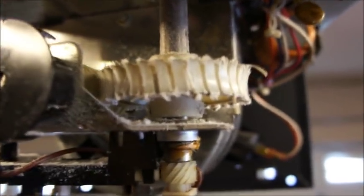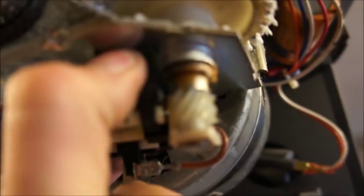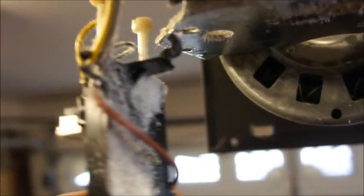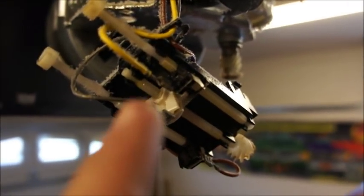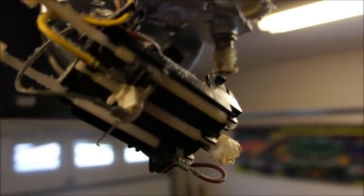Here's another look at the completely stripped out gear. First things first, we're going to remove the limit assembly. There are two small clips that hold it to the case — just pinch that and the whole thing swings down, then it carefully pulls down. The brown wire is your down limit, and the yellow wire is your open limit. The slider here moves back and forth, and it's turned by that small gear at the bottom of the sprocket assembly.